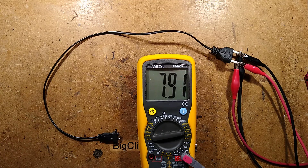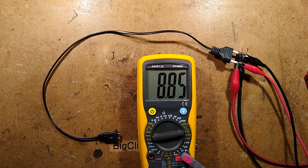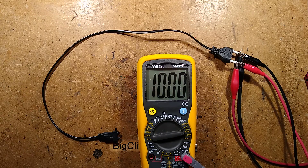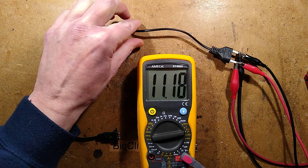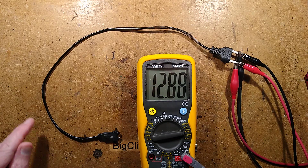I'm not seeing smoke yet but I can see the cable move slightly. At nine volts — actually it's heading for 10 volts — that's about five amps. That's about 50 watts being dissipated by that cable. Oh yes, it's very hot and stinky. It is getting very, very stinky and I can see smoke — it's all blistering.